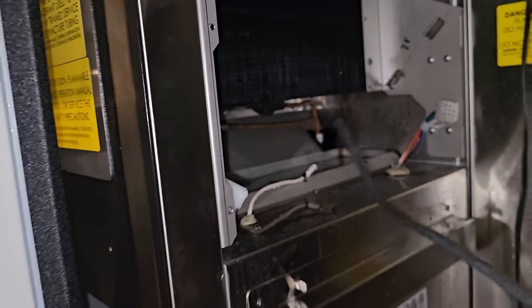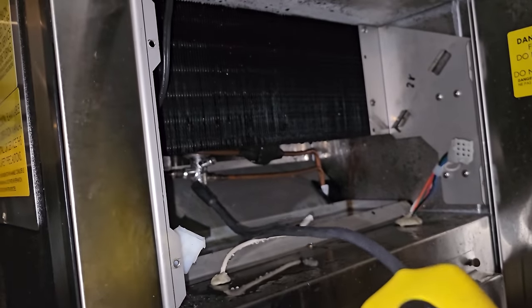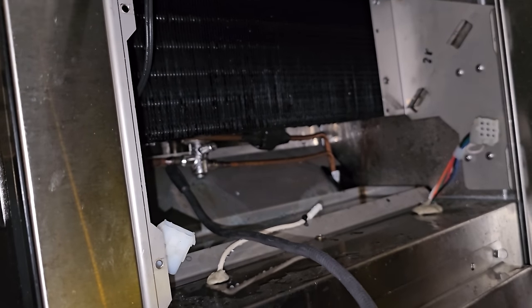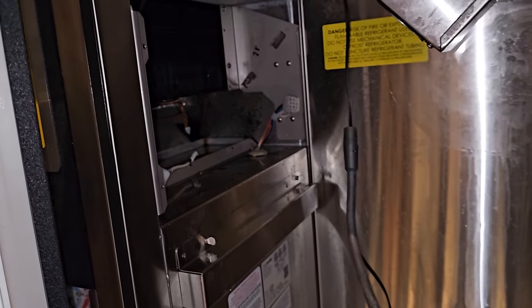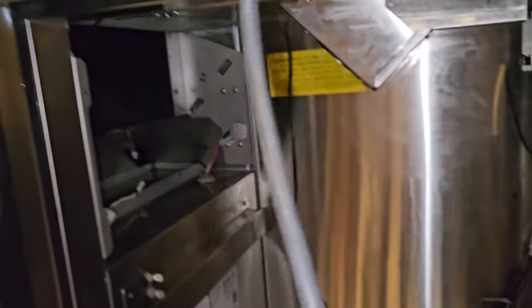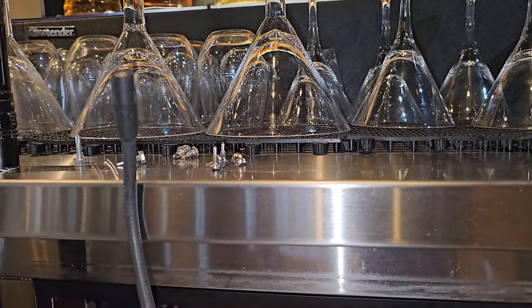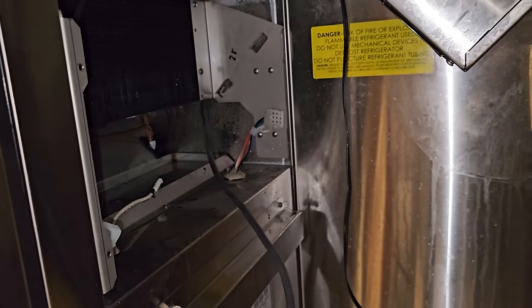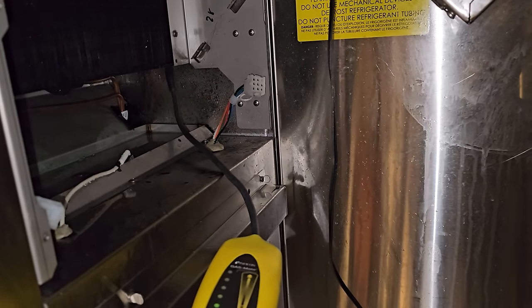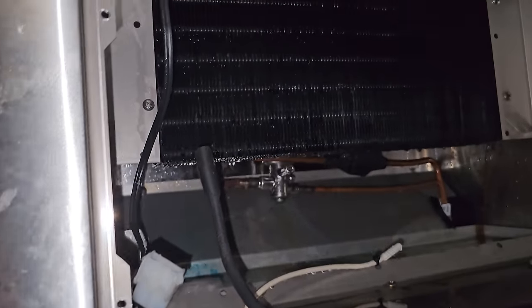Okay, let it zero out. Sometimes you get false alarms with this gas mate. Let's go over here. Ooh, it's really setting off over there. Okay, so now let's let it zero out. Sometimes you gotta pull it out of the box to let it zero out in a clean area, and then let's check the coil now. It may be just so saturated with refrigerant. Nothing under that side of the coil. Now let's go over to this side.